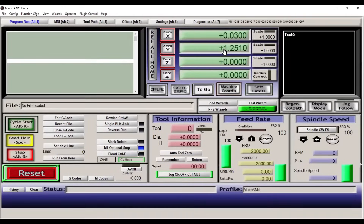If you are using a new laptop with Mach3 installed and you are trying to move the XY axis from your keyboard, the values in Mach3 are changing but your machine is not responding on the XY axis, make sure to check whether the configuration file is installed in the Mach3 software or not.